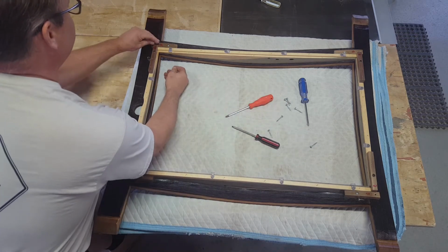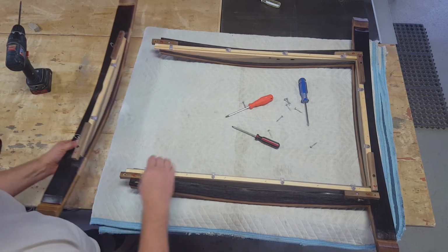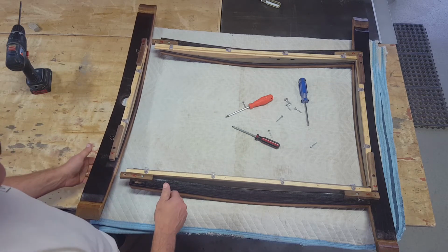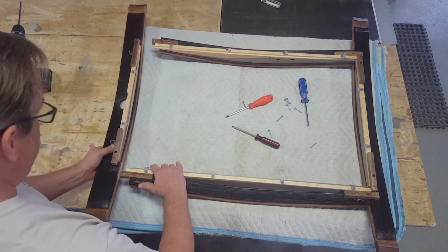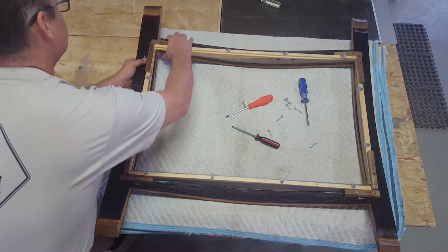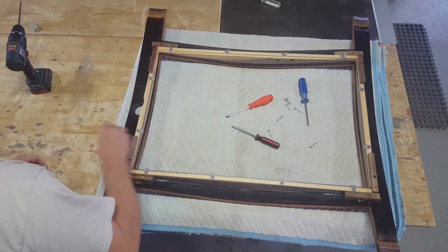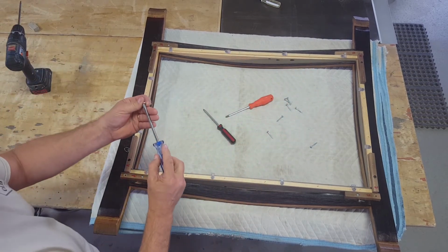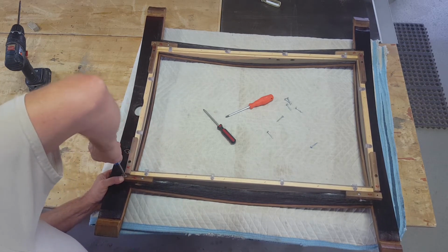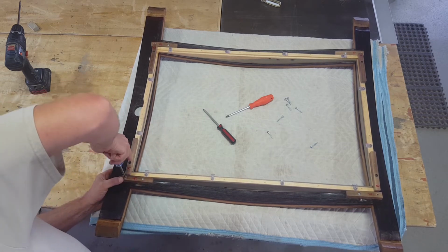Okay, so that's it. It's taken apart, the screws have been removed that keep it together. So there it is. You'll even see where the finish didn't spray on here. But obviously you can lay this thing out similar to this and just slide this in here. It'll be a little loose, so you'll just have to wait until you get one side screwed in or the other. Here, I'm going to use the Phillips head screwdriver, so this is probably the one you guys can use. I would start with this one first, the one that goes straight down, not this one here. This would be the best one to do.